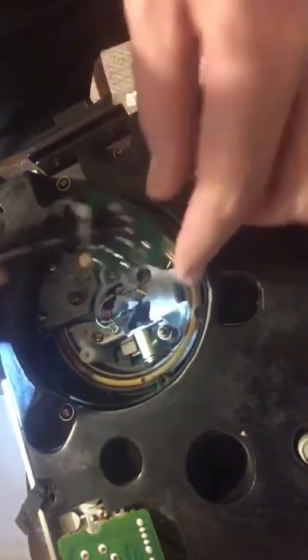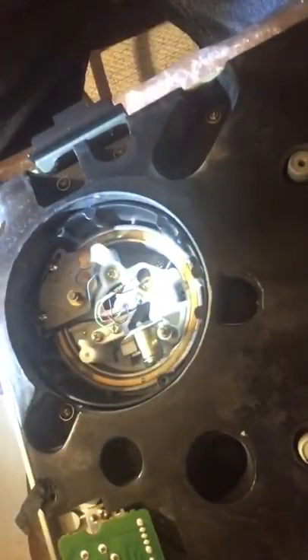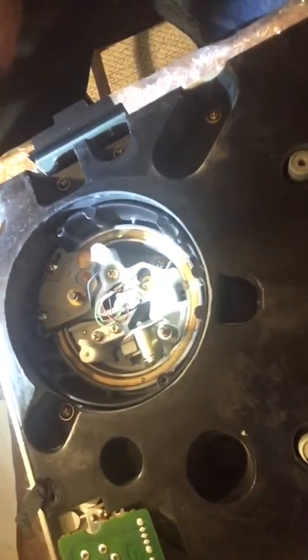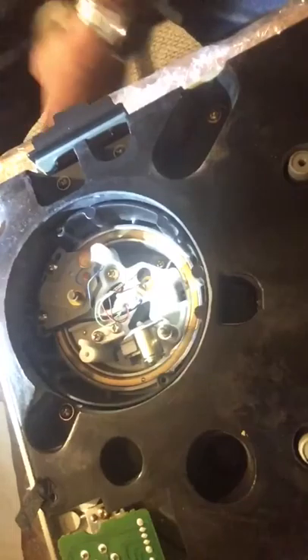Pull these aside. This connects here and here, but you want to slide it through. These cables are fat and the new connectors are fat, and they won't fit through both of them together, so you've got to bend one of these posts. I'm going to use my pliers to bend it — there, it's bent and out of the way so I can fit my new ones through.